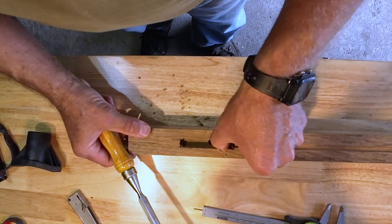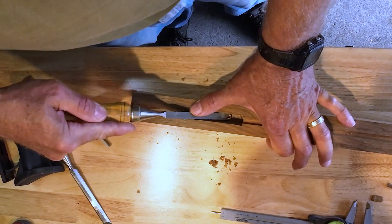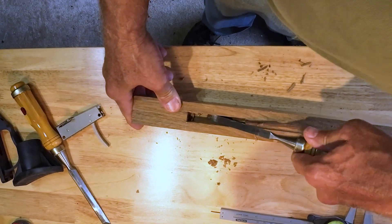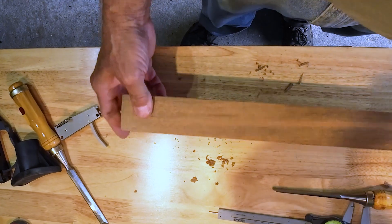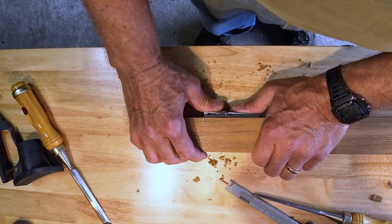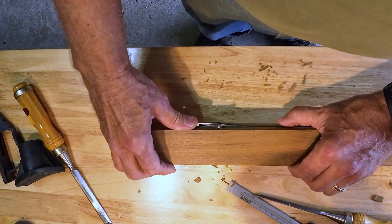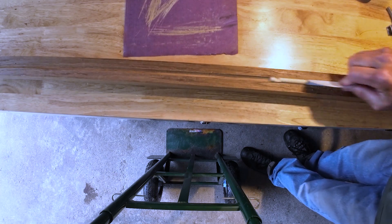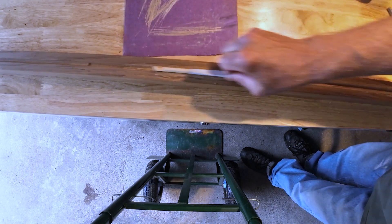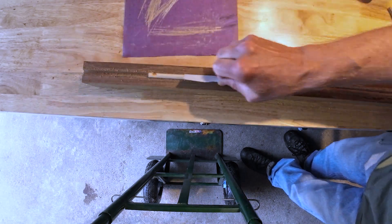The depth I found is about 0.9 inches to start, and the key is making sure that when the trigger mechanism is seated, the shaft will ride down the groove and just snap right in perfectly. After that, I take a small piece of dowel — smaller than the track — wrap it with sandpaper, and evenly sand the groove down. You can get a surprisingly good finish. If the shaft and trigger don't line up perfectly, sand a little more or chisel out the trigger mechanism until you get a perfect fit.